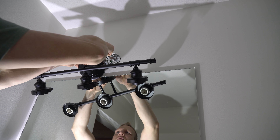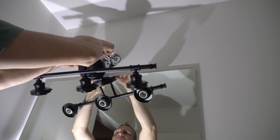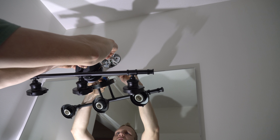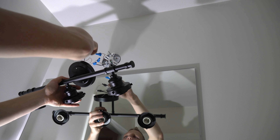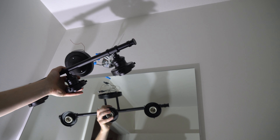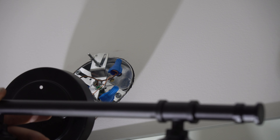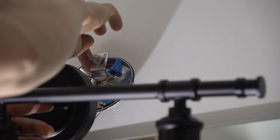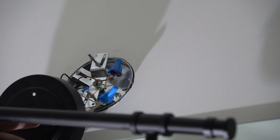The next thing I'm going to do is bring our light in. What I like to do is grab one wire at a time, twist it up, then pull the wire over and put it into the cap all the way. Sink the wire's tip all the way in and start tightening. You'll notice it gets real tight — do about seven twists past tight to make sure it's in there nice.